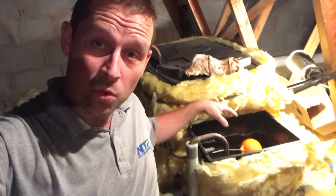We've got all the air out of all the radiators. The feed and expansion tank — the water's stopped coming in, which tells me that the water has now risen all the way up to the top. All the radiators are full, which is great. I've turned the boiler back on and put the heating on. Just want to make sure there's warmth in all the radiators and no airlocks. You'll find you need to quickly go round and let any excess air out. Once you've had a bit of time to circulate all that water around your system, any excess air will find the highest point. So just go around all the radiators again, open them up just a little bit, and make sure there's no air left in them — and that's it.